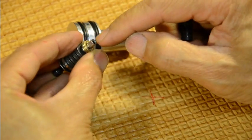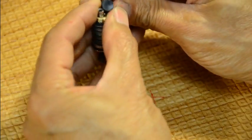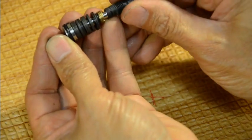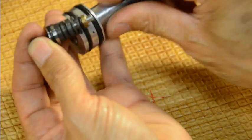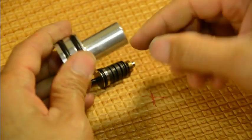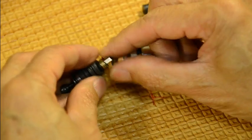See this part here of the regulator — it sits on this plastic screw. You can even see where it's been sitting. When you look through there's a hole — it's called the unregulated air passage — and it goes through to the rotor shaft.